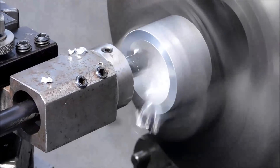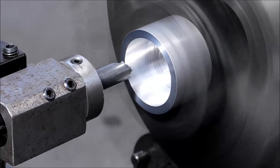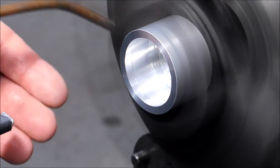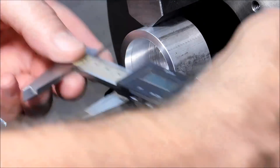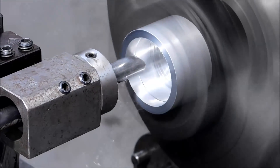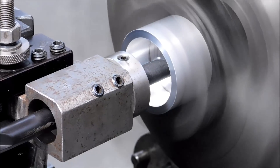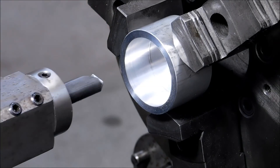I'm feeding by hand — I'm a big fan of feeding by hand when roughing. Leave the machine set to the fine finish so when it's time for the finish registration pass, you're ready. Stick a caliper on it for a quick check. If it's too hot, flood it with air to cool it down. It actually did shrink about a thousandth and a half. With the boring bar, register it against the face until it just scratches, zero out the digital, take the drill point out of the bottom first, then sweep to center, plunge to depth, knock the center out, sweep back to the bore. Nice flat-bottom hole.